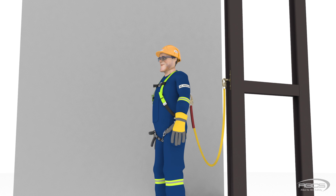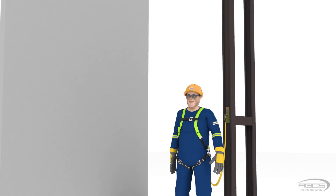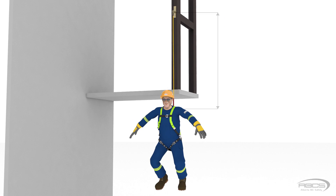What if the anchor and the D-ring are at the same height — in other words, Abel is tied off at his shoulder height? In this position, the anchor is 0 feet above the D-ring, and the anchor would need to be raised 6 feet to make the lanyard taut again, so there must be 6 feet of slack in the lanyard. Therefore, the freefall when you are tied off at the same height as your D-ring, or your shoulder height, will be the length of your lanyard — which in this case is 6 feet.